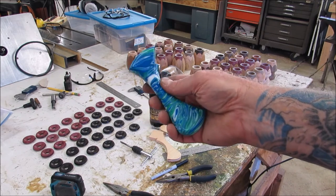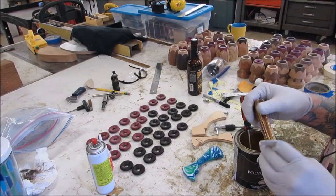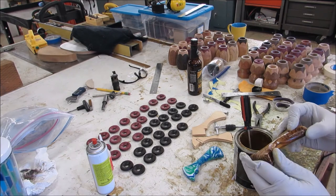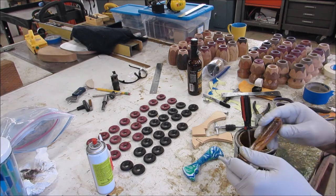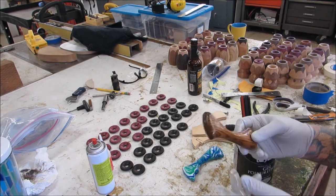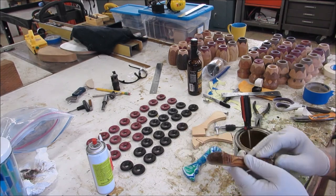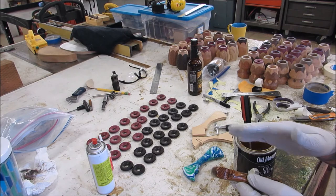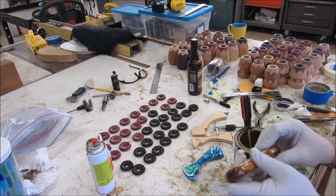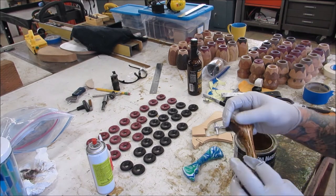Anyway, I came back and did a zebra wood one, but I have to say the freeform template routing I was doing is dangerous even if you know what you're doing. On a difficult wood like this I would not do that again with that small of a template. There are ways to add finger guards onto your templates, so if you do decide to pursue a process like this, you need a safer way to route it — that was not cool.